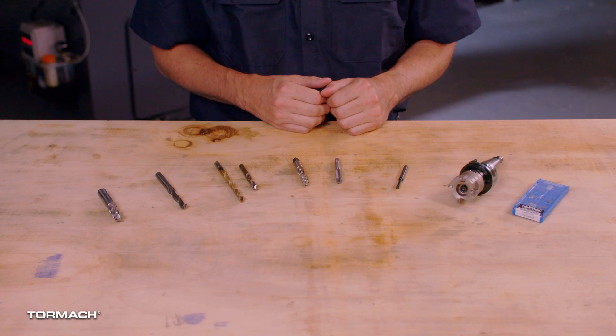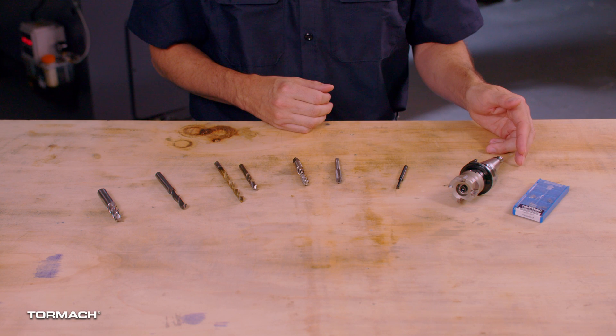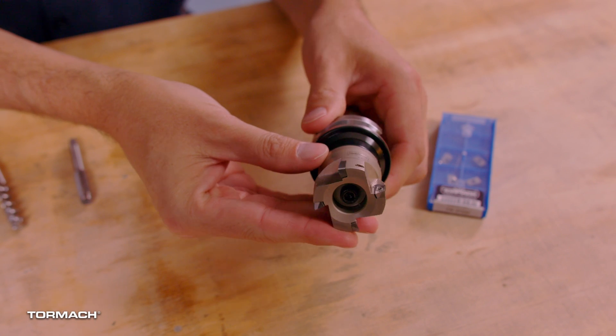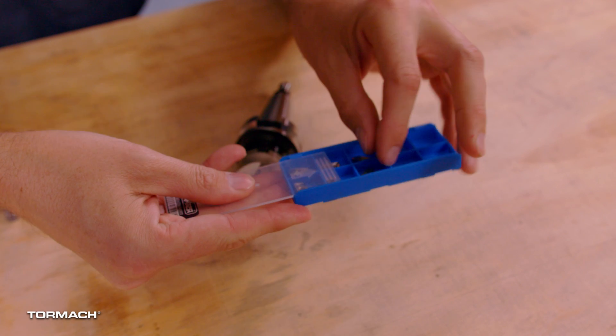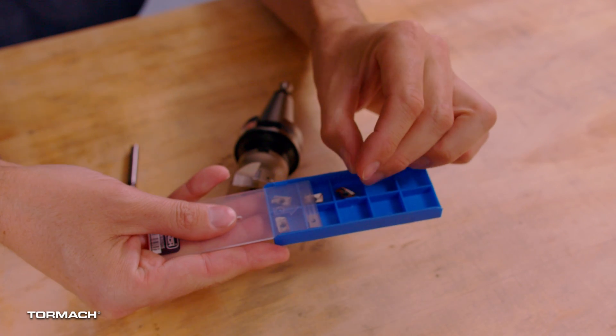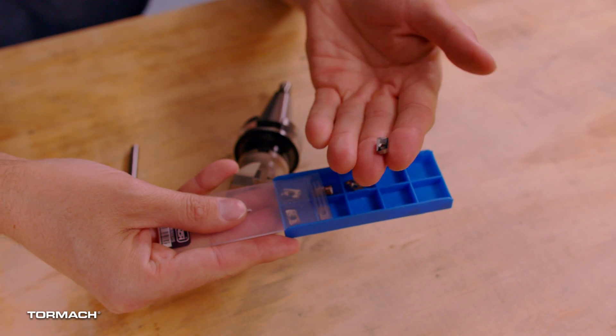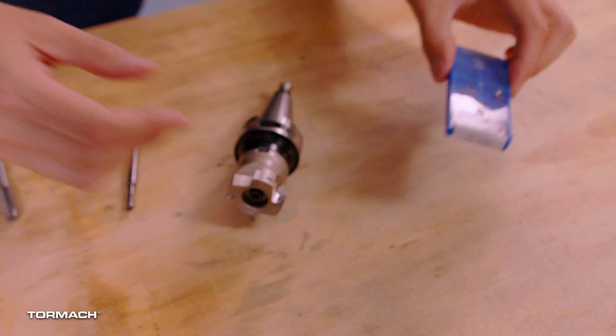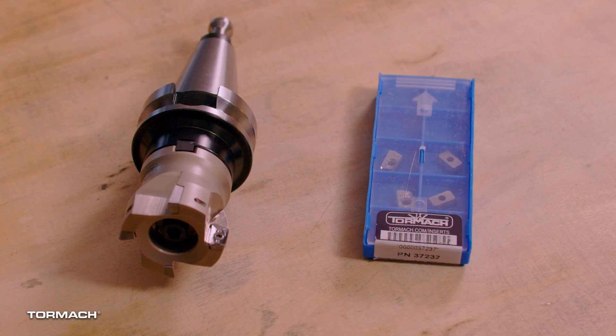For facing a part or cutting the top surface, you can use tools like a face mill, shell mill, or fly cutter. This leads me to inserted tooling. Notice on this face mill it has interchangeable inserts. These can lower your operating costs, because if they break, you only have to replace the inserts. You can also change the inserts depending on the kind of material you are cutting. Face mills are also cost effective for larger diameters, as the costs of end mills can go up quickly over half an inch in diameter.